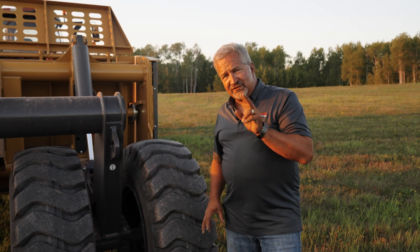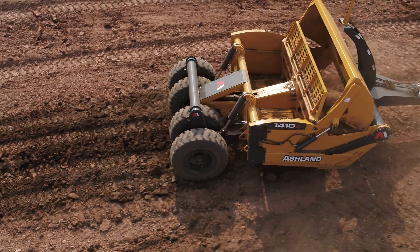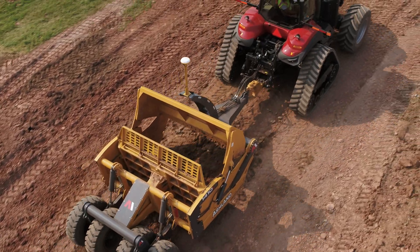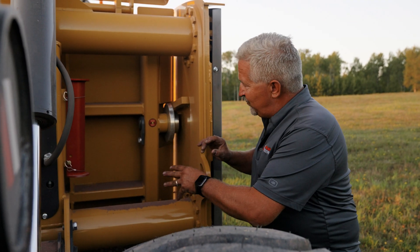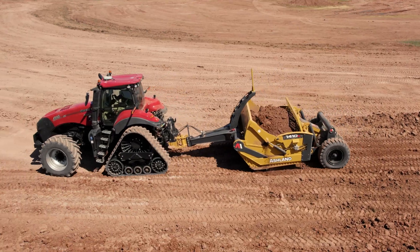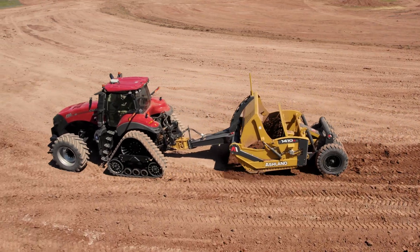These four tires have two spindles — it's like sharpening a pencil on both ends — with hubs on each side. So if you get material in front of one tire, the other tire can keep rolling. The push-off is guided with four roller systems: two on the floor and two mounted midway up. This hold-down roller prevents the push-off from going side to side, as well as from material building up on the floor — it keeps it struck off nice and smooth.